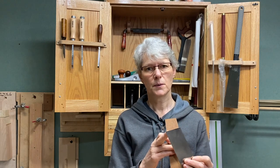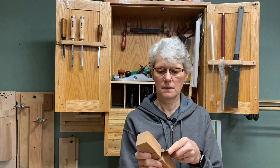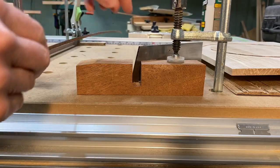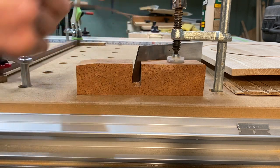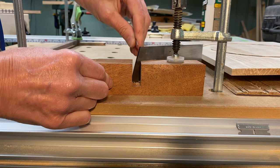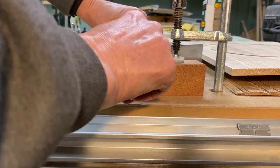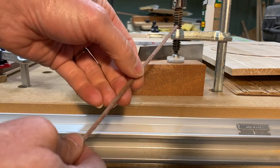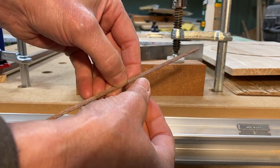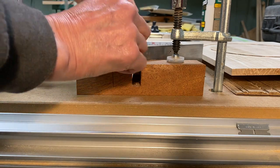The edge of the card scraper is sharpened just like you do a card scraper normally. At the very end, this fits into the groove. You're going to have a small gap left between the wood and the blade. Make sure that the angle is towards the way that you're pulling out, otherwise it's going to force this blade back as you cut. Just line up one side of the string with the outer edge of the block and pull this through a couple of times. After a couple of pulls through, that'll create a beveled edge on the lower edge, enough to sink into the groove and allow for a tight fit once it reaches the width of your groove. Just two or three passes through here should be sufficient.